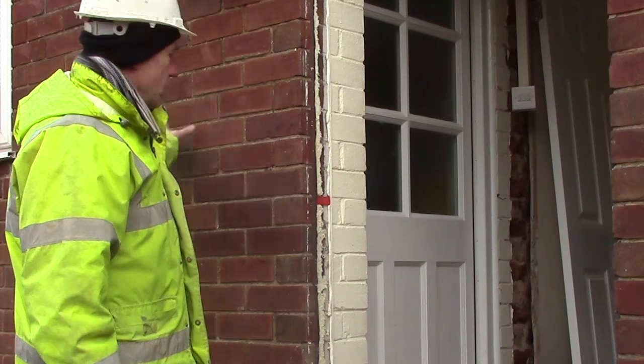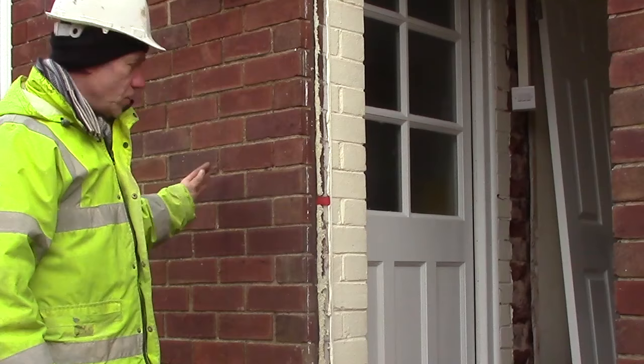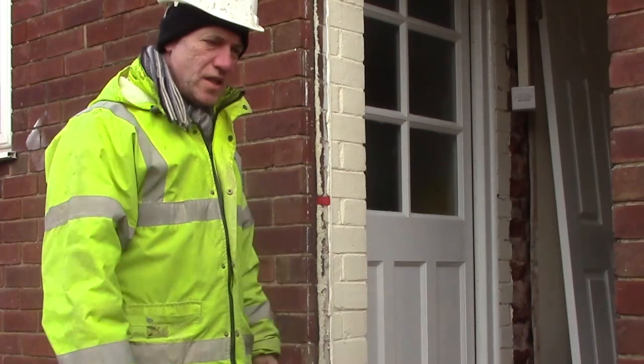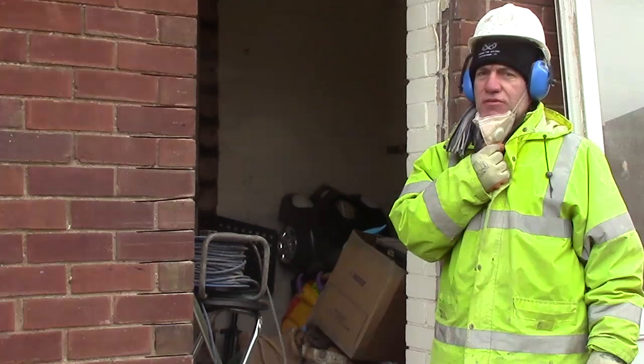Because it's close together, I've decided to chop this side out first — toothing. And when that's toothed, I'll disk down there because there's a lot of knocking here. As I take the bricks out, I'm going to build them back into here. So this is the project on Saturday morning. It's cold, it's February, so we've got to really crack on. I'm on my own today — my labour is away — but I'll get this job done hopefully today.